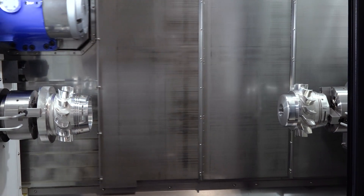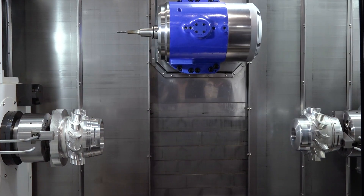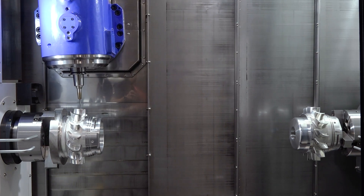These are eight-inch chuck matched spindles — true integral motored spindles — with the b-axis head for flexibility. Right now we have matched spindles, but later we can add a tailstock or a lower turret for future applications. This is perfect for that one-and-done workflow — raw material into the main spindle, spindle two handles the second op. We use a roller-type b-axis head design, not a worm gear, giving us zero backlash and super precision.